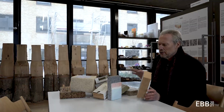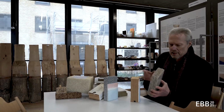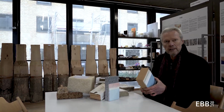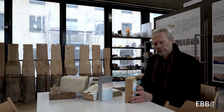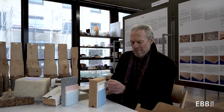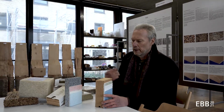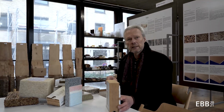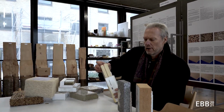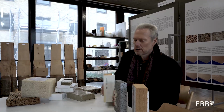This is an alternative. So in front of me we have different types of insulation, and this insulation can be covered by wooden siding or aluminum siding or something like that, but you can also put a stucco directly on it. So here you can see that this stucco has different parts. There's a base material, then there's a reinforcement integrated here, and then there's a final layer which gives the color to the stucco as well. And as insulation materials, we have a wood-based plate here. This is styrofoam based. Here we have polyurethane containing a lot of primary energy, so this is what we're trying to avoid.